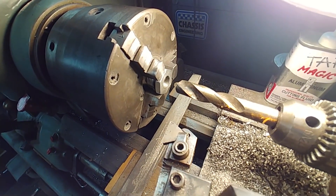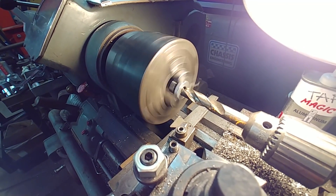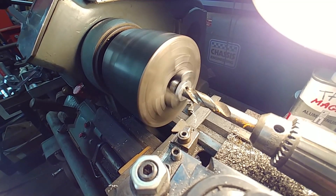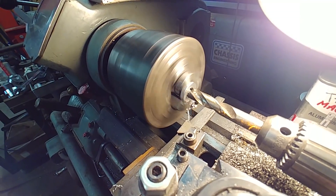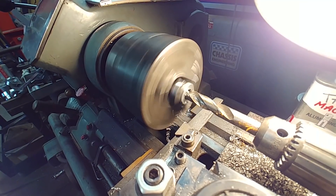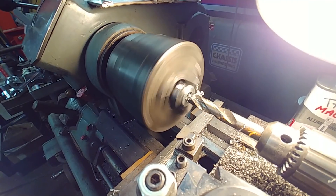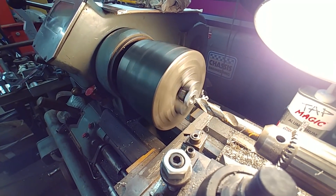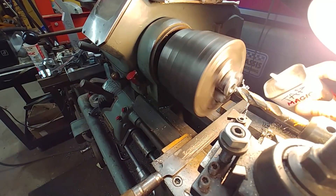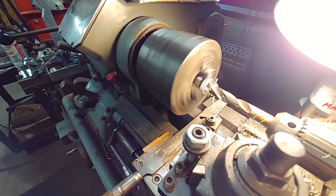This is the old aluminum plug that goes in the top of the re-drive, and I'm just drilling that out to a larger diameter so the tube will go through with a little bit of clearance — about 12 thousandths. The tube slides in there with a little bit of play, which is what I want. Ultimately I'm going to put a recess in the top of this nut, and that'll allow us to put an o-ring around that 4130 tube along with some washers and a nut, which will seal off the top for a nice airtight seal.